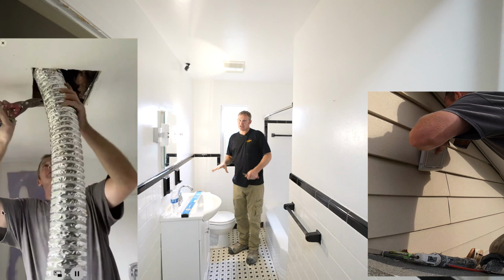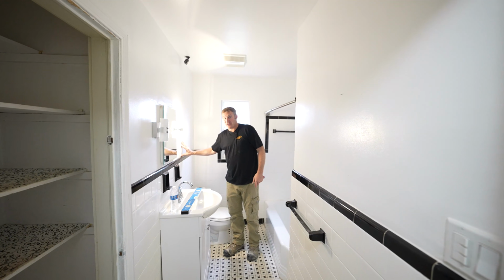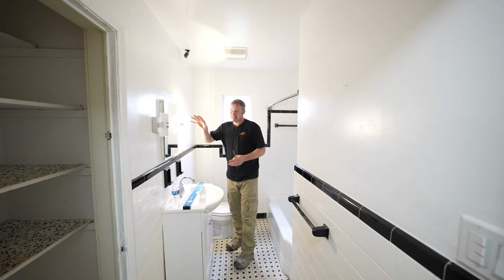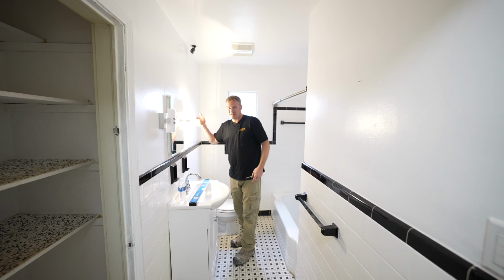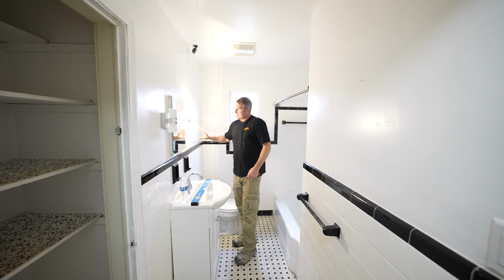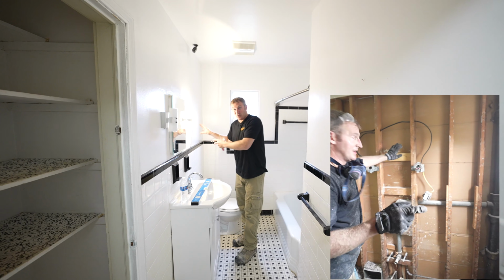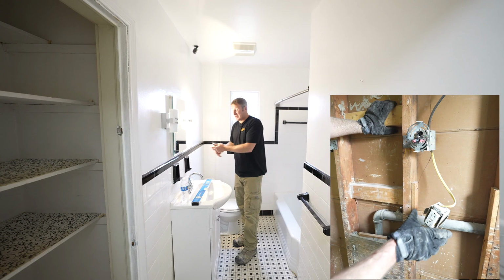Now, when it comes to electrical, 50 years ago, they usually didn't even have outlets next to your vanities. A lot of times they actually had medicine cabinets that were light fixtures with plugs, so you would have an outlet in there. So when you see a new GFI, it's most likely either connected to the lighting circuit, or doesn't have a new line run to it. So you have to kind of evaluate that.